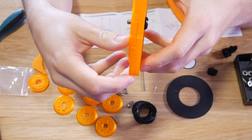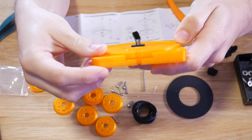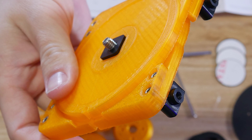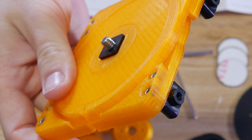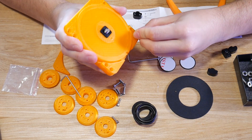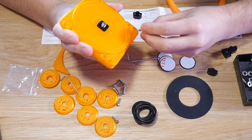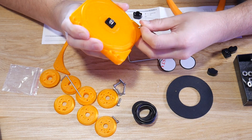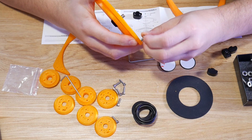The parts held down to the print surface but then would shrink inward as they got further from the surface. Depending on the cross-sectional area, where the sides should be vertical they weren't, which meant the dimensional accuracy of the ABS parts went right out the window. This actually led me to doubt whether Edelkrone had even put clearances into their parts to allow for 3D print inaccuracies.